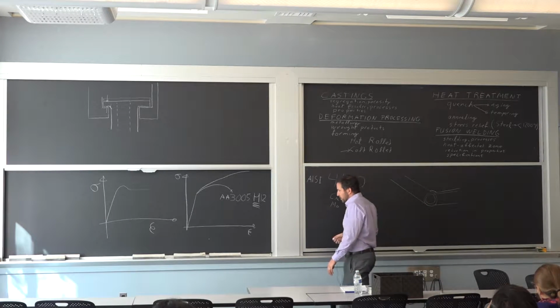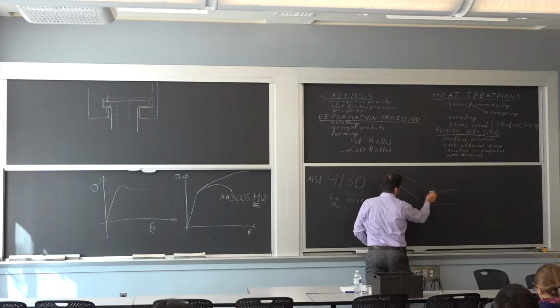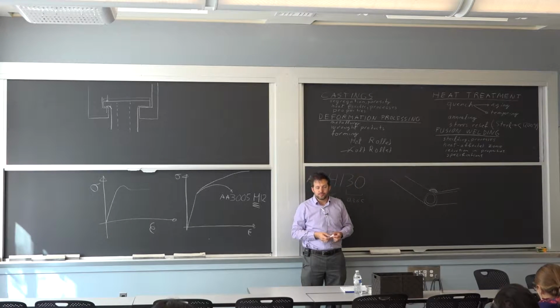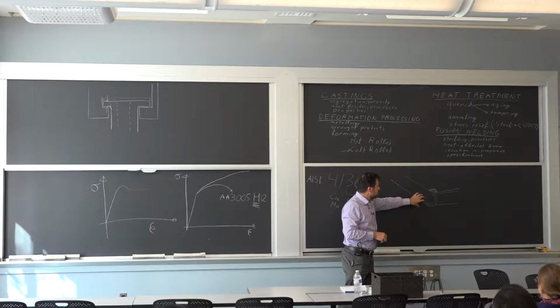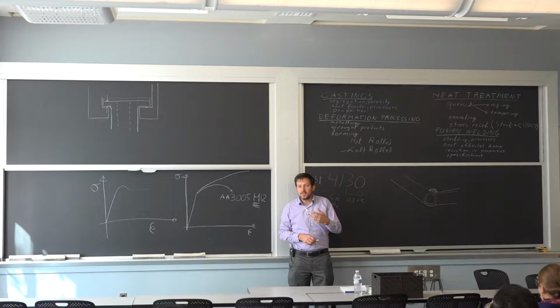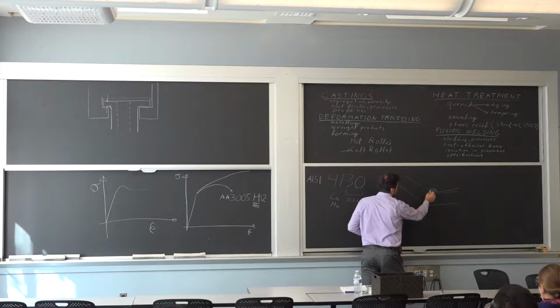When we were talking about sport equipment, bikes, and all this, we said actually a lot of times the weld is going to be a little bigger because you don't want to heat the base material too much. It's very thin, otherwise you'll get a burn through. So one aspect that ties a little bit of everything together here is you'll see that with this geometry, I'm adding as much, if not more metal than the thickness of the member that I already have. When it's the time for cooling, it's not the heat affected zone that's just next to the weld here. So say this becomes my fusion zone, so I have my heat affected zone here.